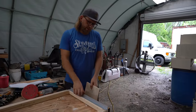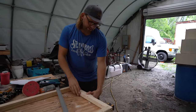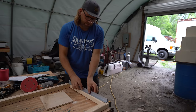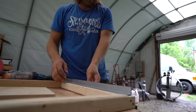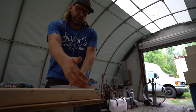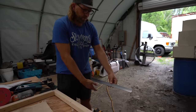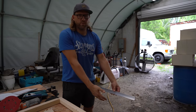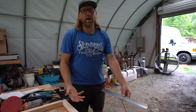Instead of the design we've used in the past where there is a face that is set past it, that supports the slats, I'm going to use this angle to unify all of the slats, and it can stay flush here, so I'm not having to add any bumpers on either side. I'll be able to pull this out, which has all the slats connected to it, and then it can nest into a channel that we put into the wall, or maybe a bumper. Either way, this will just connect to the wall. We don't need that face of wood to support the slats. So we're basically saving about an inch and a half by doing this.